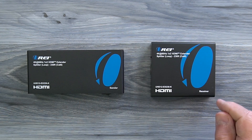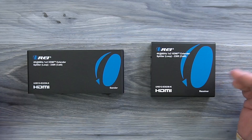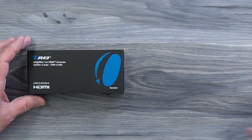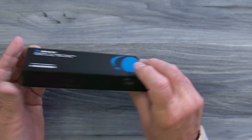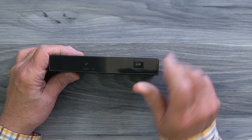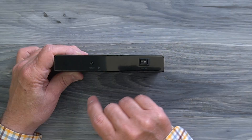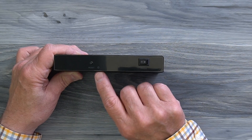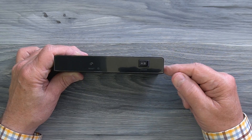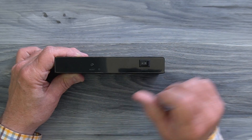Inside the kit you'll find a sender module and two receiver modules. All of these feature full metal enclosures which make them incredibly durable and help minimize outside interference with the sensitive electronics inside. On either side of the sender module you'll find mounting holes that can be used with the included bracketing kit. On the front, starting on the left, you'll find a reset button — hold that down for a few seconds once power has been applied to reset the module. To the right of that is a power indicator. Once you add power, the module starts an internal power-on self-test checking the electronics to make sure everything is working. Once it passes that test it'll light the LED letting you know the module is ready to use.